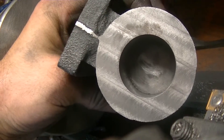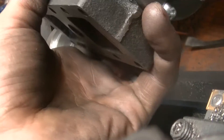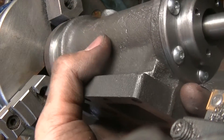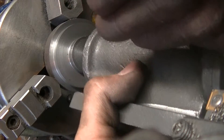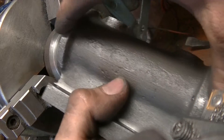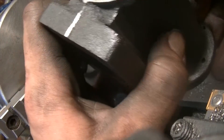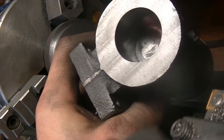This side is a little off-center, and that's because it's very difficult to line up a rough casting this long that you need to bore through. If you're off just by a little bit, that error is going to be amplified over this distance - it's like an error leverage. I did the best I could but still couldn't get it right on the money.